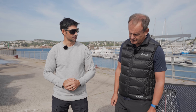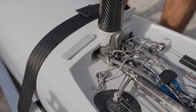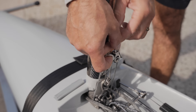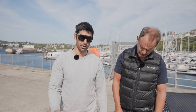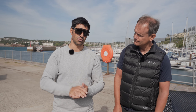Yes, exactly. Looking at the Cunningham, you've got more Allen blocks but two hooks — why two? Our sails have two skins, so either side of the sail there's an attachment point with a loop and you just hook on. There's a 4-to-1 purchase here and then further back there's a 6-to-1 purchase, which makes 24-to-1 going to the Cunningham. The sails have become a lot stiffer in the last few years, so the Cunningham range is only 60-70mm from full-off to full-on. The aim is to keep the bottom of the sail sealed to the deck even for take-off and downwind, for better performance.